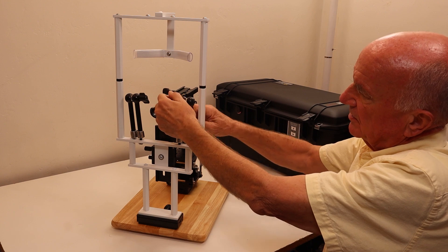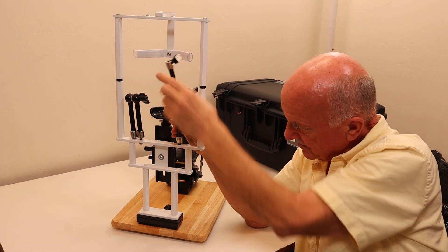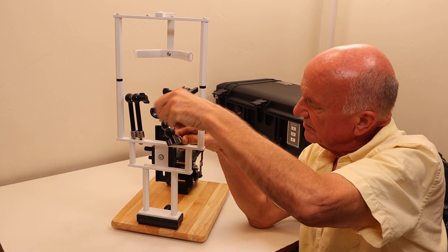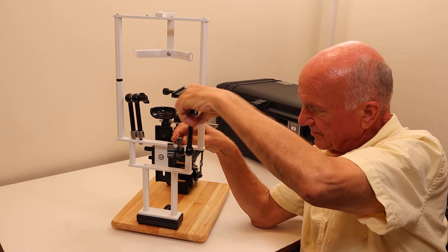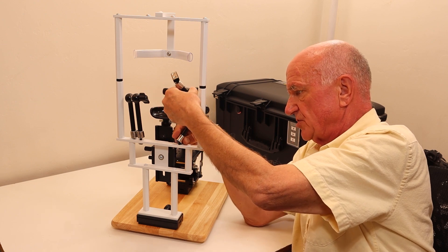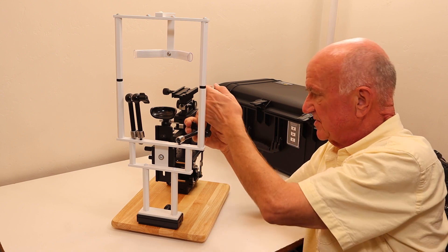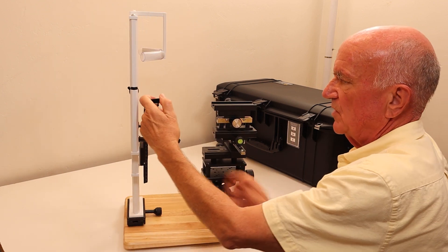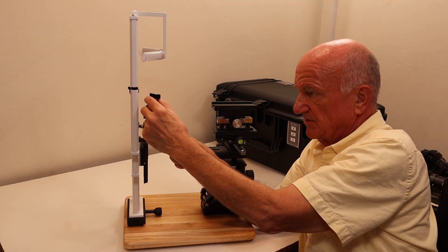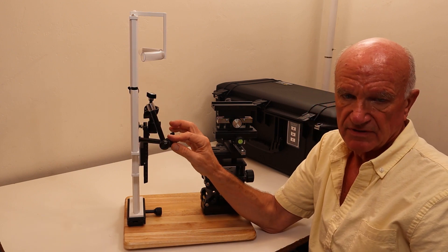These arms do take a little time to get used to, and the important thing I found is knowing that you can turn this collar here, the sleeve, so that it can roll down. Generally, most of the time when you're using it, it will be in the horizontal position. The first arm generally will be in this horizontal position, and the second arm will have your magnet put at the right angle. Most commonly I'm putting it right here at 75 degrees, and then clamping that up like that.